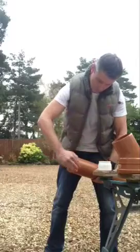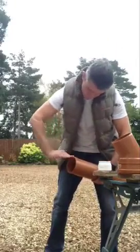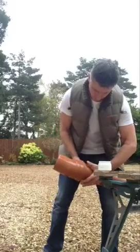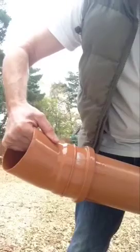You are now ready to make the joint. Apply silicone lubricant all around the end of the pipe. Offer the fitting up squarely and push it smoothly onto the pipe. When you feel the pipe meet the internal wall of the fitting, withdraw it about 10mm just to allow for any future expansion or ground movement.